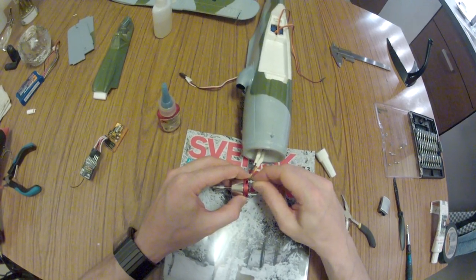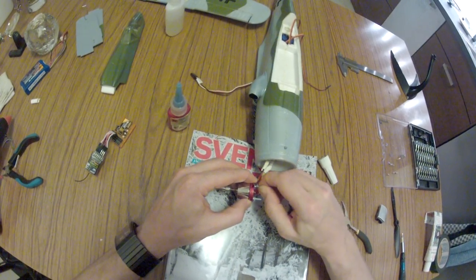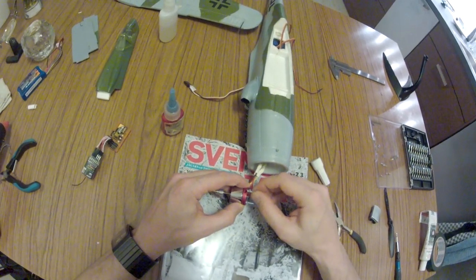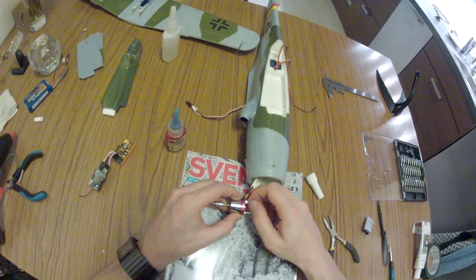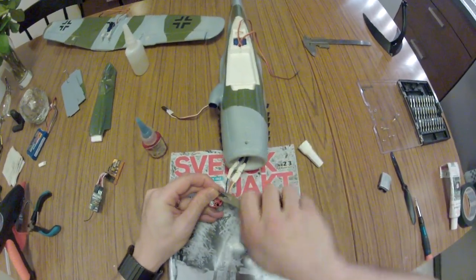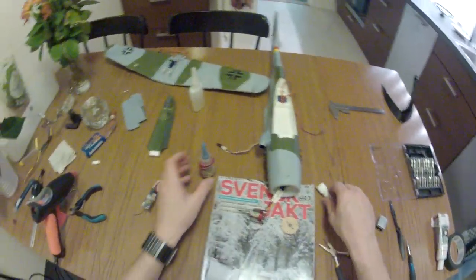Getting the Loctite into the threads. Getting the thread into the engine. Homemade threads like this always have small flaws at the top, so it can be tricky to get the right thread in. There we are. Just tightening it so Loctite can work its magic. Afterwards, the screws will sit there quite firmly.